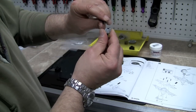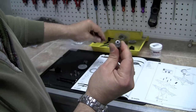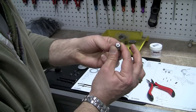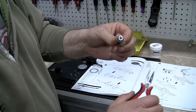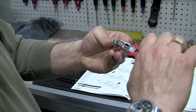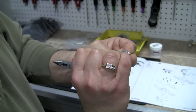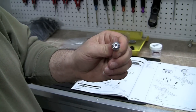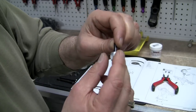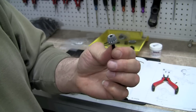It's beveled down in there so I don't know if my bright idea of using my C-clip tool is going to work — it is not. So we're going to revert back to fail safe and use a pair of needle nose pliers. It's always fun working for the camera so you can laugh at me. We're going to press the C-clip on, just like that. Make sure it snaps on, and you can use your nail to rotate it around just to make sure it's fully inserted. When you're done with step number one, the shaft should be secured to the gear. See, that wasn't that hard — we're through step one and you haven't cut your finger off yet.